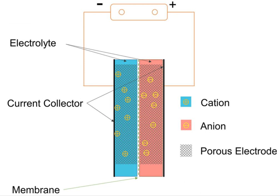Aqueous. Water is a relatively good solvent for inorganic chemicals. Treated with acids such as sulfuric acid (H2SO4), alkalis such as potassium hydroxide (KOH), or salts such as quaternary phosphonium salts, sodium perchlorate, sodium hypochlorite, lithium perchlorate, lithium hypochlorite, or lithium hexafluoroarsenate (LiAsF6), water offers relatively high conductivity values of about 100 to 1000 mS per centimeter.